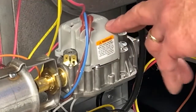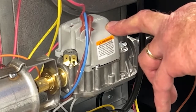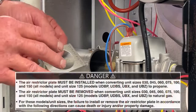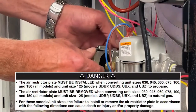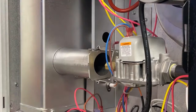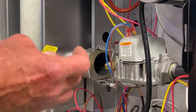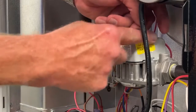These are half-pound gas valves and must not be connected to any gas supply that exceeds one half pound, which is 14 inches water column. Next, after completing the installation of the gas orifice, we need to install the gas restrictor plate. Please confirm in the manual for the LP conversion kit that the model you are working on requires the gas restrictor plate — model 75 takes this plate. You just slide it in, hook it over the backside, and close the tabs. The last thing we need to do is install the conversion sticker to the Honeywell gas valve indicating that this valve was field modified for LP gas. Now we're ready to install.